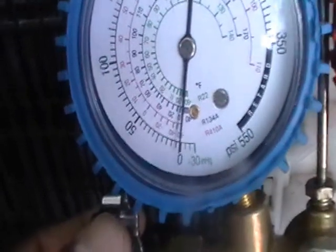What actually happened is that this access valve — this bullet piercing valve — was placed on the line to test pressure in the past. But as you can see, there's a little curve here. When the pin punctured it, it was on a curve, at a little tangent, so the refrigerant was slightly leaking out. I've back-seated the screw already right here, and if you look at my low-side gauge it says zero, meaning the system is totally empty of refrigerant.